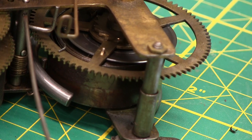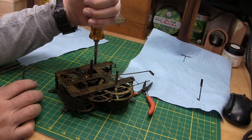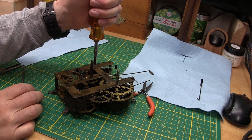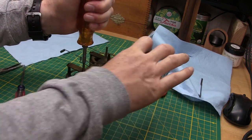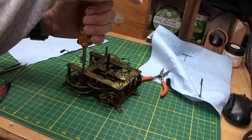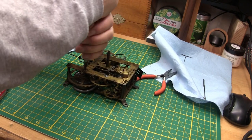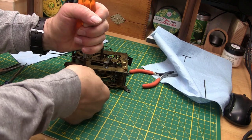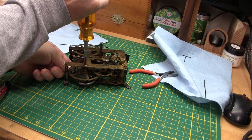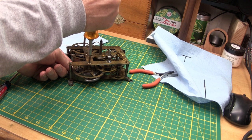In this Japanese clock the spring is a little bit different. I'm gradually letting this go — I'm not just letting it spin like a crazy thing. What the spring is doing is expanding while I'm doing that. My retaining clip has fallen off, so I need to wind it back up without re-engaging the click, and just push this back up. Now that clip is in the middle. I'll go back to releasing and just letting this unwind in a controlled manner. That's how you do it.